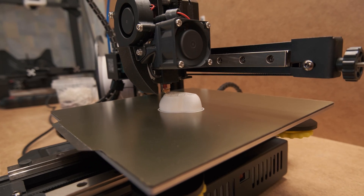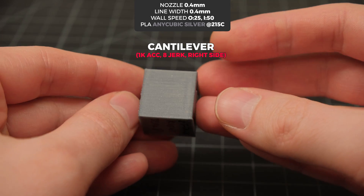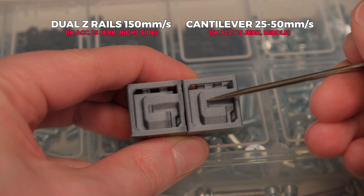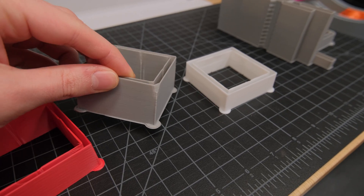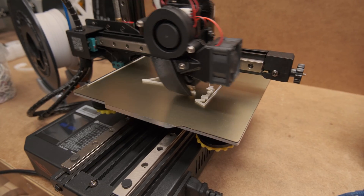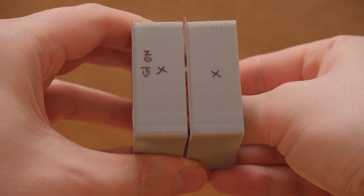So does all this mean that cantilever 3D printers are flawed and you shouldn't buy them? Well, not really, because it boils down to two scenarios. If you are not pushing them fast, they can still provide good quality prints with minimal ghosting. Not to mention that with slower speeds you will get less bulging on corners, so it is not even worth it to print faster on stock firmware that doesn't have any linear or pressure advance options to reduce those bulges. However, if you are thinking of higher speeds, accelerations, and especially Klipperizing your 3D printer, the cantilever design is not the choice for you — because with Klipper you can print at faster speeds without quality loss, but the axis wobble means input shaping won't be effective here either.